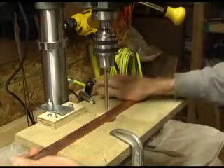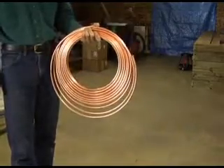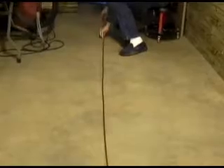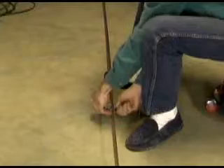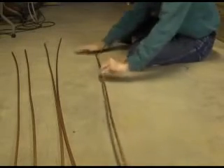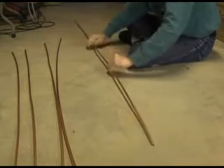My small copper tube has a 3/8 inch outside diameter. The smaller copper tube is 1/4 inch inside diameter. It is carefully unrolled on the floor to prevent kinks. I use 60 foot rolls because it divides perfectly by 90 inches. The larger diameter tool allows the smaller copper tube to be marked and cut at exactly 90 inches. The copper pieces still have bows in them, so carefully bend the copper tube as straight as possible. I have found that smacking against a flat surface does a nice job.